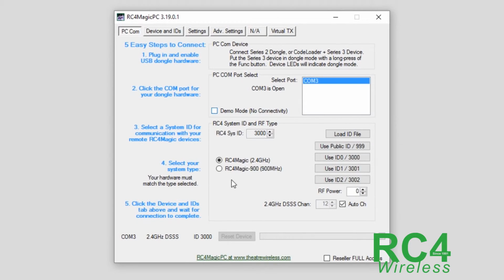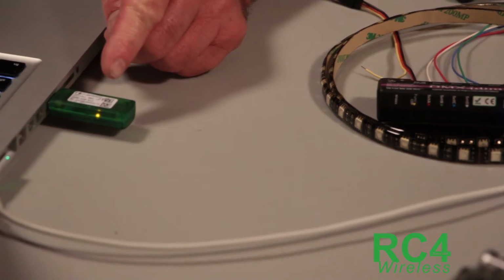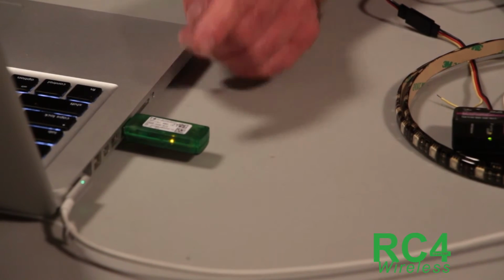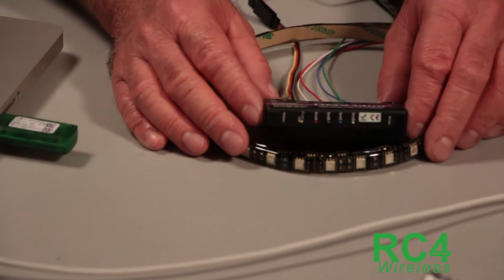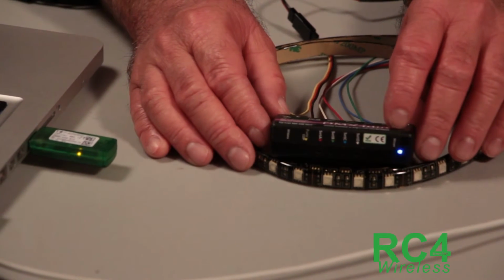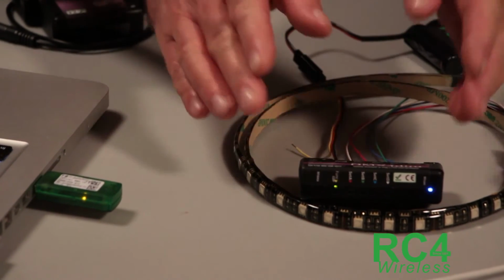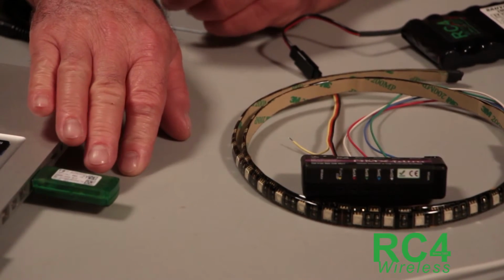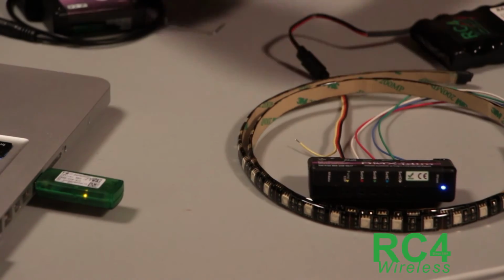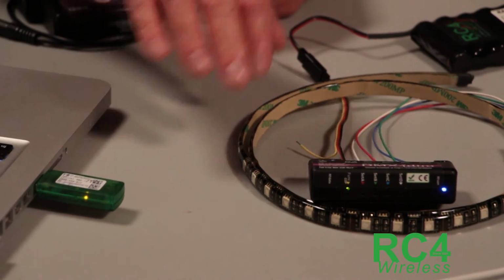So now with these settings on screen and done correctly, we can click any other tab and watch the configuration happen. And this LED switches from being solidly on to blinking. And over on connected devices, the blue LED, in fact, was solidly on until it connected, and now it's blinking. So these are between devices that are remote. This one's powered by a battery. This is a DMX4 DIMM, and here's my dongle. Really important. If these two things are both blinking, you have an active working network. If you're not seeing one of them or both of them blinking, there's a problem.